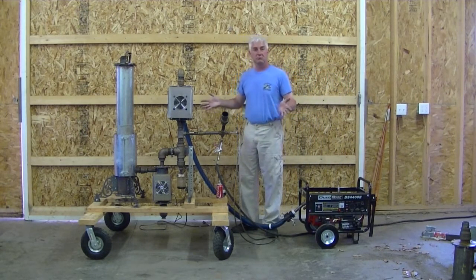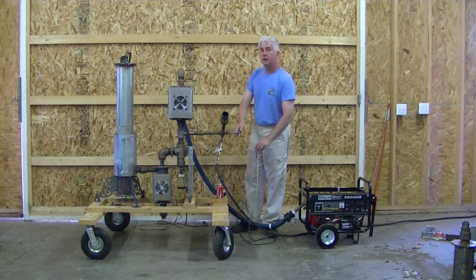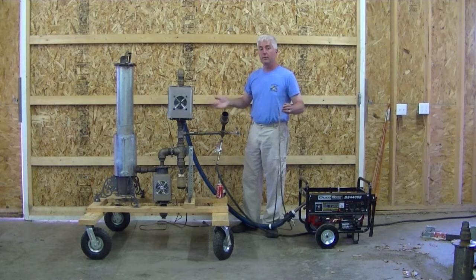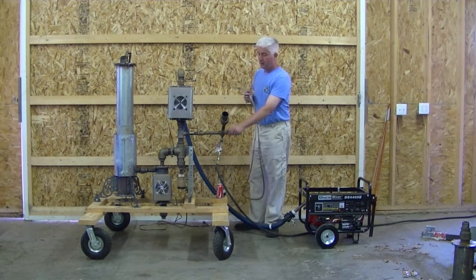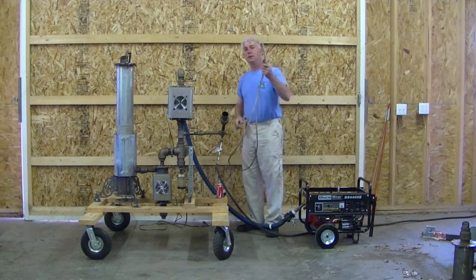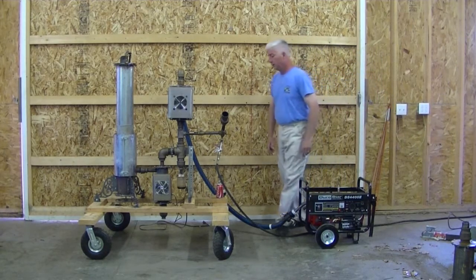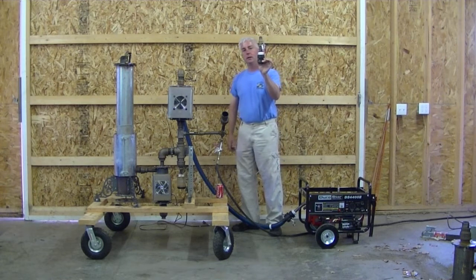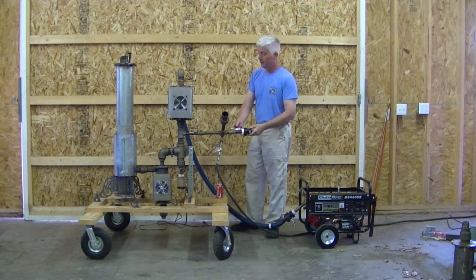So I made some changes. What I did to fix the problem is I primed the pipe — primed the delivery pipe. Doesn't sound like rocket science, but on my ejector, I took off the manometer and got rid of it. What I did was put on a gator lock coupling and a ball valve. This just screws right into the side of the T.